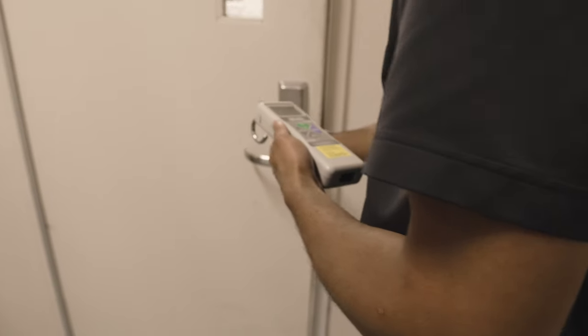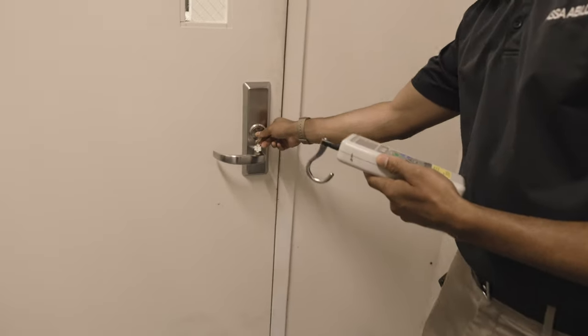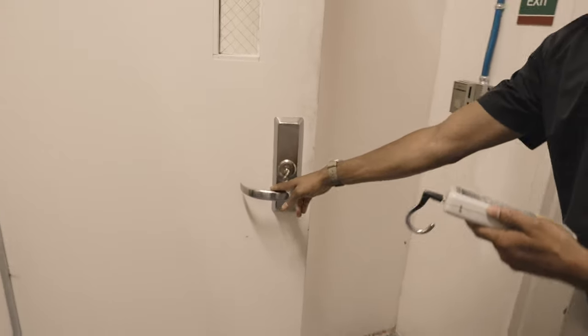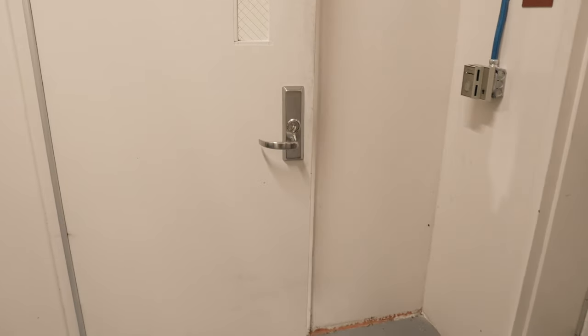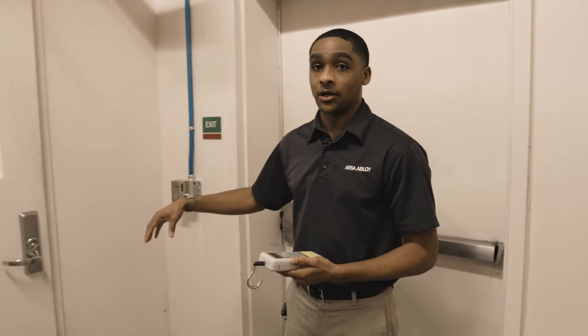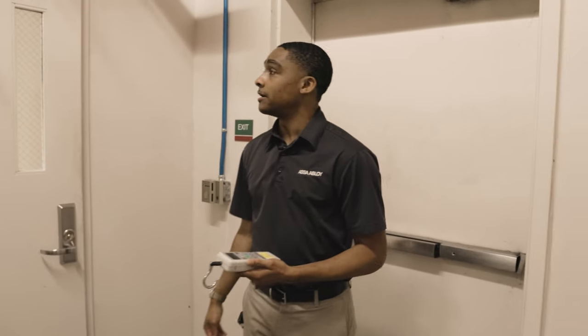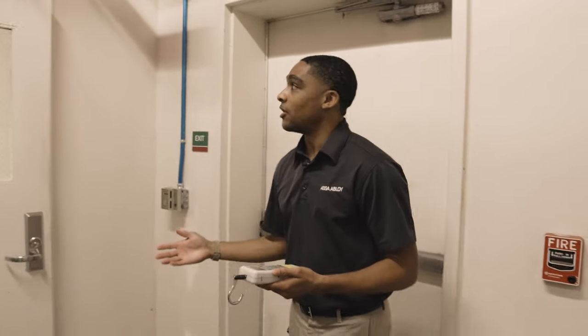I noticed that we're not latching here. Let me close this and see how this door is performing. So my door is now not latching. We've just illustrated two of the trade-offs that you'll typically see in a door like this in a stairwell where we've got positive pressure. There's quite a bit of air coming through this crack here, and these trade-offs are a result of the technology that is in most of the closers in our industry today.